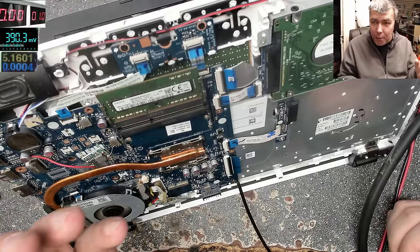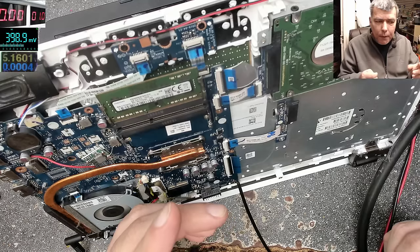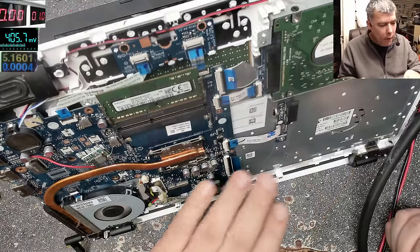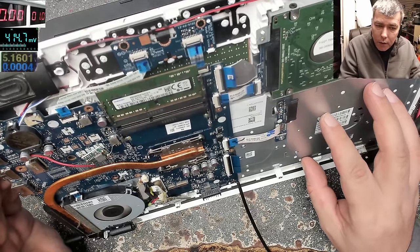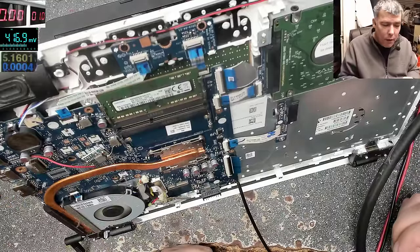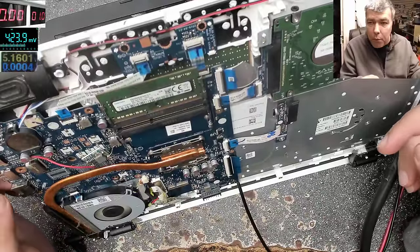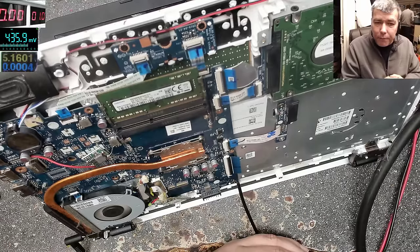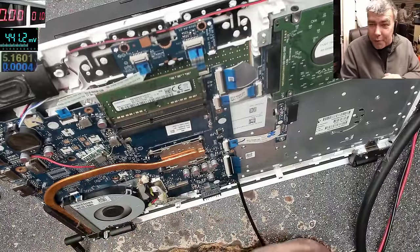So when you design a 5 volts power supply, that power supply must be able to supply power to the hard drive, to the USB ports, to the DVD ROM, and maybe something more. That's how you design a power supply. So in that case, when everything is on, like the DVD is working and you have a phone connected on each USB port, maybe at that point the power supply will reach its limit, you know? But I'm sure my modification will be fine. I'm sure about that.